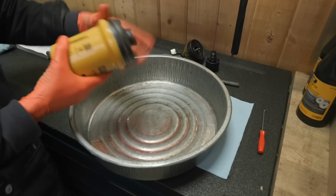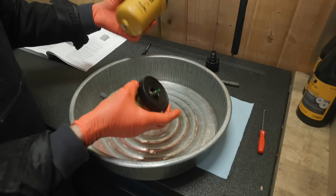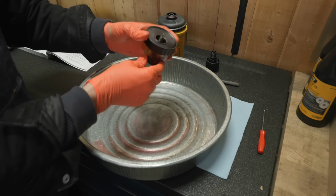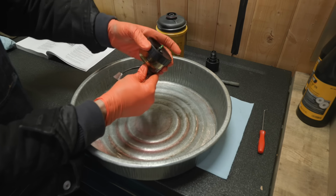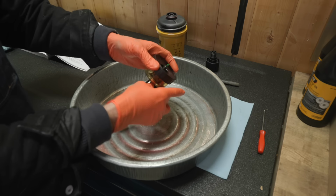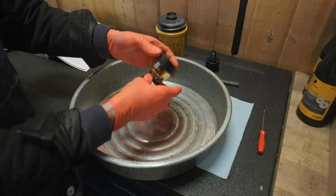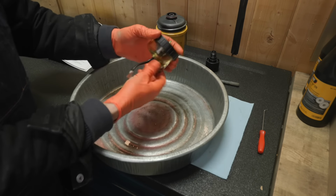This is our new fuel filter, and this has got a float bowl on the bottom. I was just noticing there's a lot of goobers and water and even particles in here. So I'm concerned about my fuel tank. I've got a 500-gallon fuel tank that I bought on Craigslist or Facebook Marketplace, whatever it was. It's pretty old, and I have got it filtered, but I'm going to keep an eye on my filters, because look at all that sediment in there. There's even some water in there.